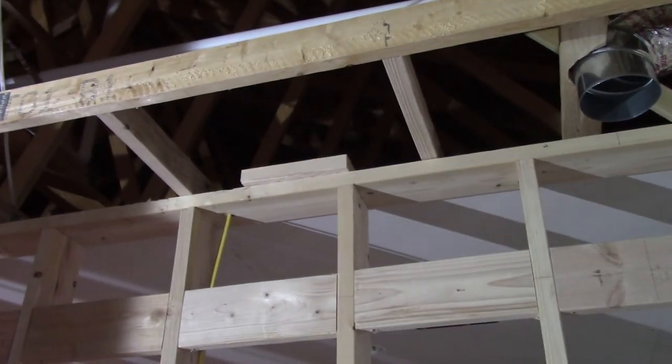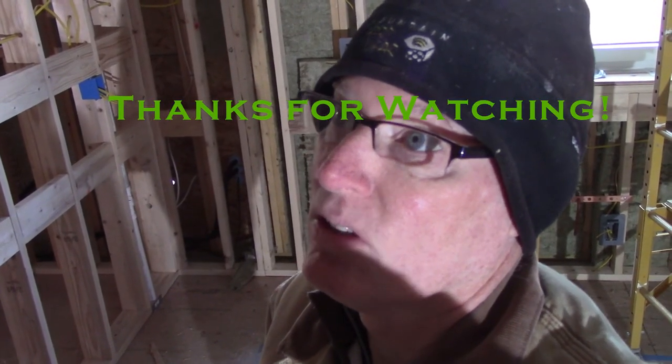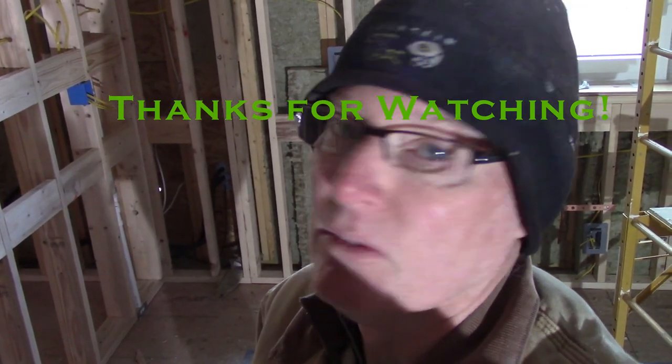The Building Science Corporation has some papers on how to deal with truss uplift and explains it well. There's also information out there on floating sheetrock, floating ceilings, floating walls, and floating corners. But in a nutshell, that's truss uplift — dealing with a structural member where parts are moving in different directions at different times of the year. Thanks.